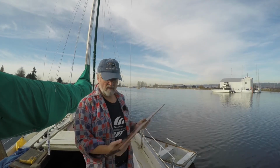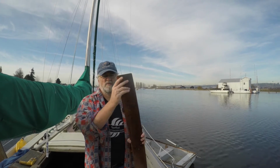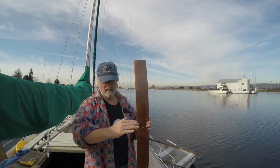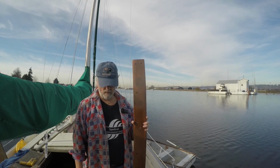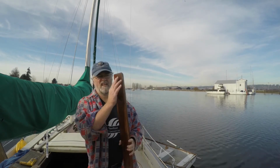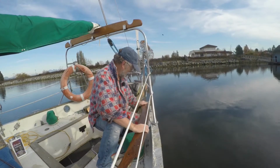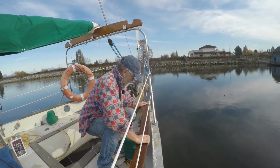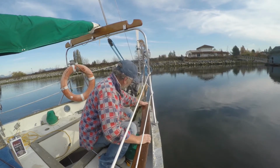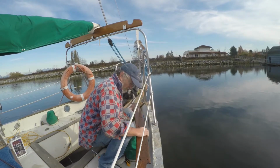The other challenge I've got here is with this beveled edge. The piece of teak that goes over the curve on the bulwark didn't fit very well, so I installed it with bedding compound, and it left a lip. Here I can feel the lip, and I don't know if the camera will pick it up, but you can see how the teak doesn't line up.